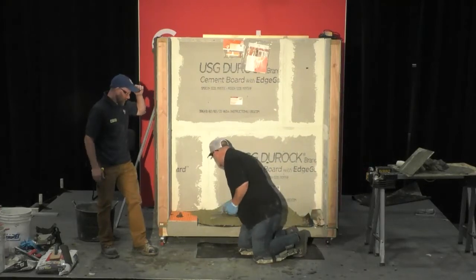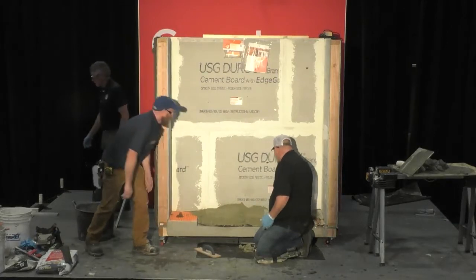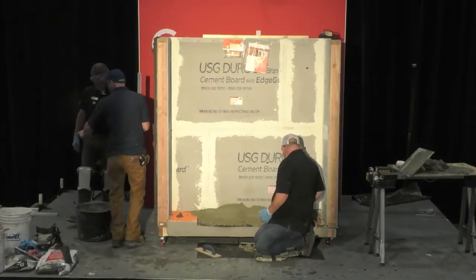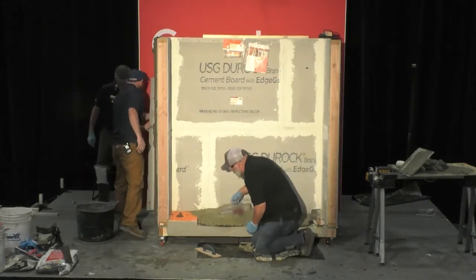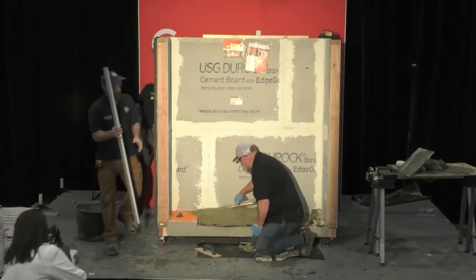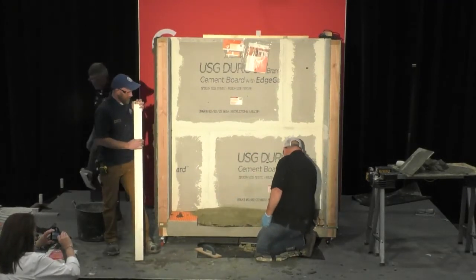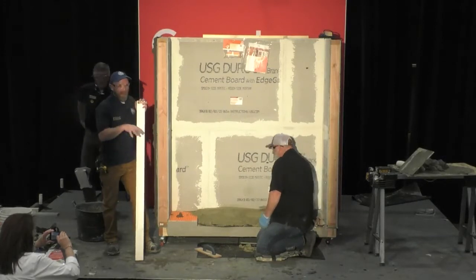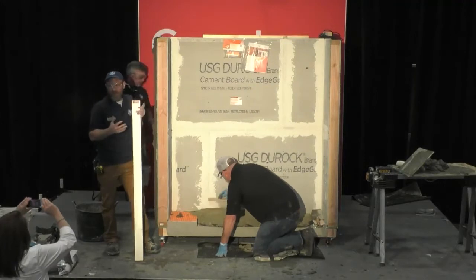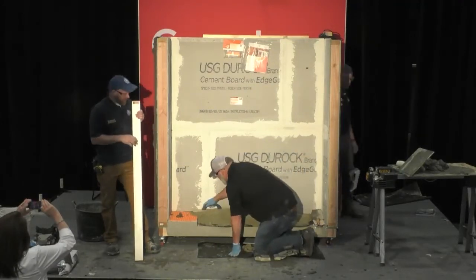What I'm going to do here — and you can see how dry this is — is I'm going to put too much material up here and I'm going to compact it. It's real important that when I compact it, that gives us a lot of compressive strength. But I want to set my mud up in a way that it's much higher than what I really need in order to get some good compaction. The compaction is when it gets its strength. If you just throw it in there loose, it's not going to get the strength it needs.